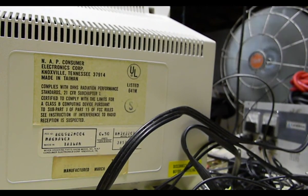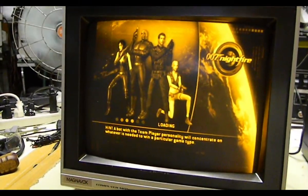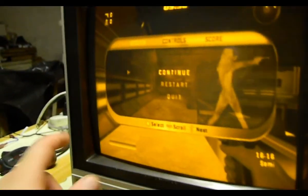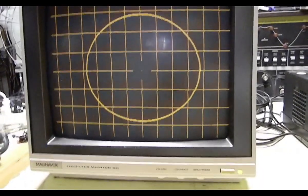Horizontal refresh rate — horizontal sync is at the wrong rate. Can I adjust that from the outside? I don't think I can. Wait, vertical's wrong too. I'll play around with this a bit. So I adjusted the vertical hold and I don't know why the horizontal went back into place — I did knock the thing and that must have been enough. It has — the horizontal hold on here is a tune slug type deal. Now I'm gonna play around to get the best possible picture out of it. The CRT looks a bit more worn down than my old one. I can see the little composite artifact, so maybe this thing is perfect. So this thing does not work properly — its condition improves a little after run time.